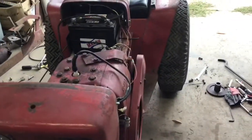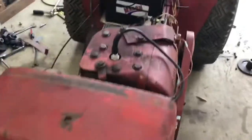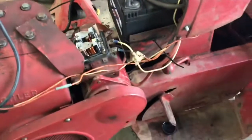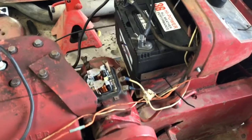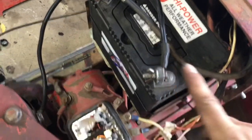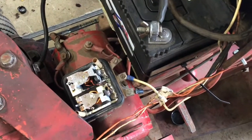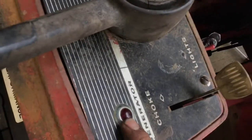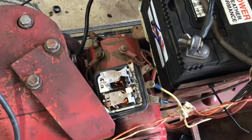Uncle Jim's got rear tires to mount up when we get to Wisconsin. Really my only thing left to do is figure out this charging issue. From what I've read, if I jump from the negative terminal to the F terminal and this light goes off, that means it's charging — and I think that means the regulator is bad.